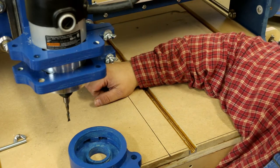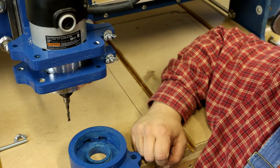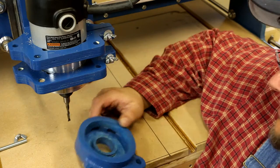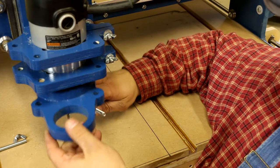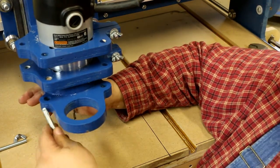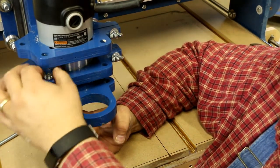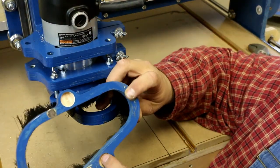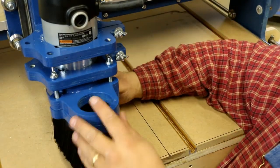At some point I'd like to try and get an actual spindle — I've heard they're much quieter. I don't know if there are any decent companies with spindles for the home market that are affordable, but I would like to get one at some point. The way this dust shoe goes: I push it up here, then use carriage bolts to come up through and tighten with a wing nut — just finger tight. I've got cutouts for the screw heads drilled with a Forstner bit, and it just suctions right on.